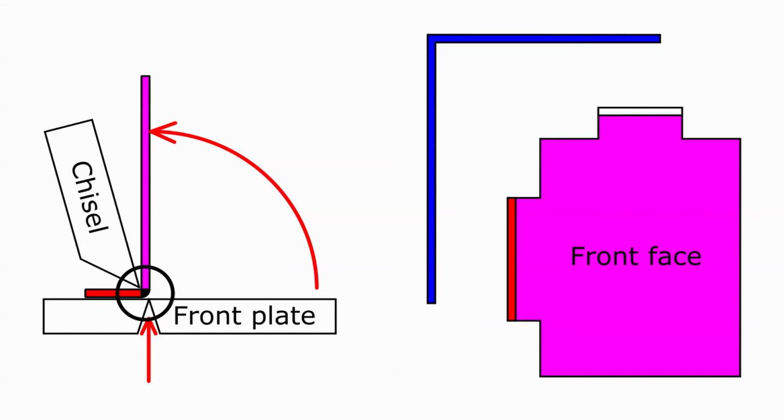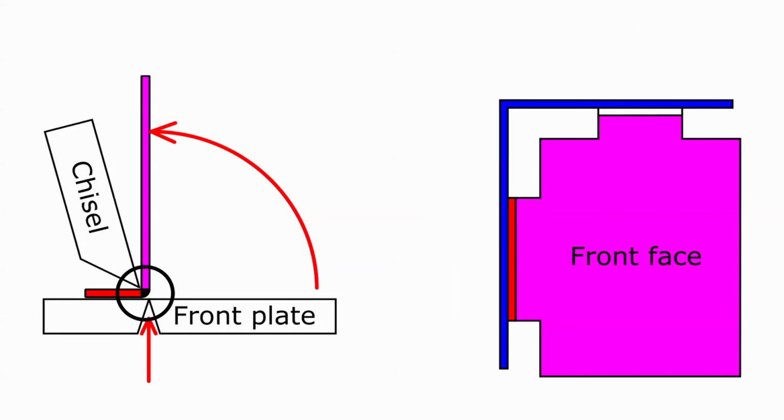After the tabs have been bent, the front view will look like this. When the cover is moved back into contact with the tabs, it will be slightly further away from the face, by the thickness of the sheet, than the line drawn on the pattern. As we will see, this will not be a problem. There's no need to adjust for the radius of the bend.